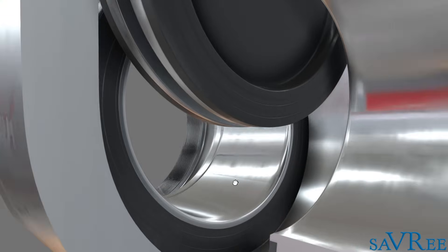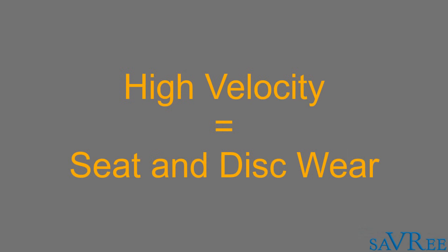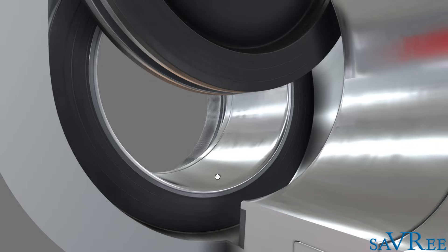This is gonna be proportionally quite a large amount of flow with a high velocity. This high velocity often leads to seat and disc wear. The other problem, apart from the high velocity, is the turbulence. As the flow passes through this small gap between the disc and the body, there is a lot of turbulence. And this also creates a larger pressure drop, which again is what you don't want — this is resistance to flow. So gate valves are not very well suited to throttling. In fact, they should either be only fully open or fully closed.